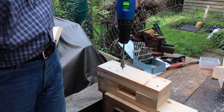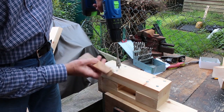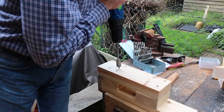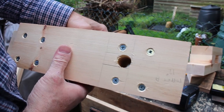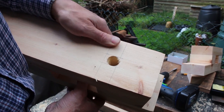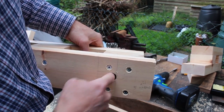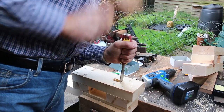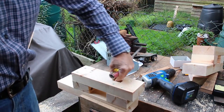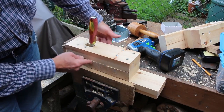I'm going to drill out the angled hole first, and then drill a straight hole going straight down so that the two meet up. To get your angled hole, follow the angle — you can use the wedge to help line your drill bit up with it. I've now drilled through the angled hole in one of them, and as luck would have it, it's come out pretty well spot on. The idea now is to drill a vertical straight hole — not angled this time — and then chisel out the waste.